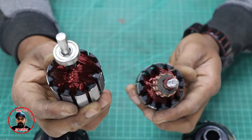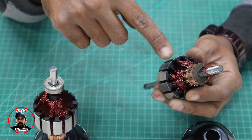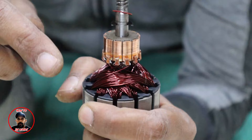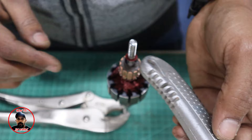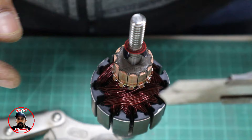Now I will rewind my original motor and show you how to do it. First I will remove the old winding and explain the procedure — which pattern to remove it in, so you can remember it. This is the lock here. It is very easy to open. You can use a paper cutter and a hammer to open the winding carefully.